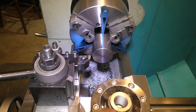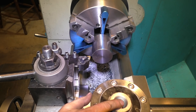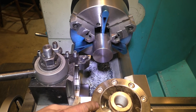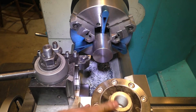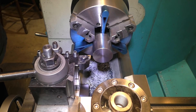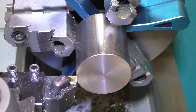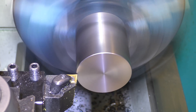Here's the 100,000 pound load cell. We're going to be doing some 1-1/4"-12 threads, single pointed, giving about one inch of threads. The top could take more, the bottom about one and a quarter, so we'll do both at about one inch since the threads aren't holding the force so much as the faces on the other sides. We need to reduce this diameter down to the major diameter, which is somewhere between 1.2368 and 1.2482. We have to take off so much material — I'm going to try 100 thousandths depth of cut at a 7 thousandths per revolution feed rate at this speed.